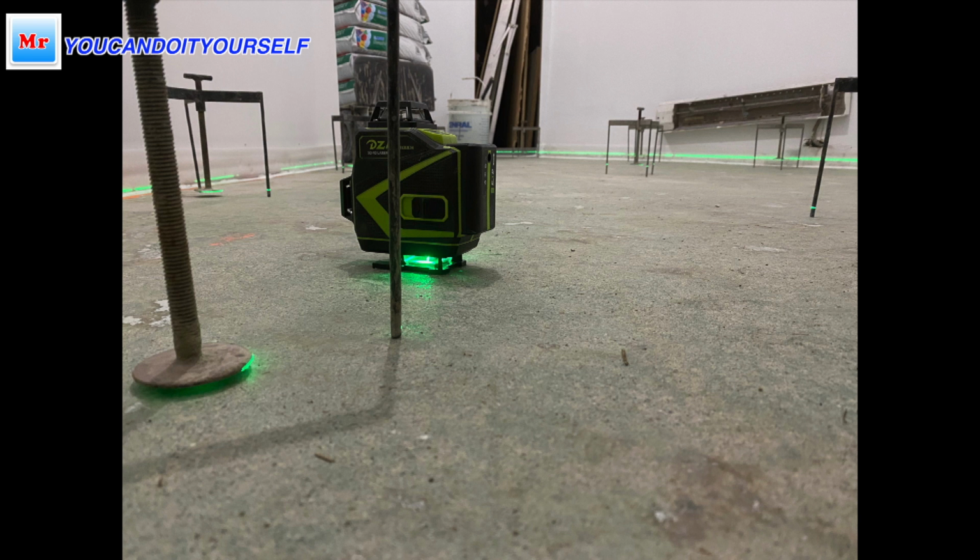For this leveling you need to use the right tools. Here is the 4D laser level, where we have a bottom laser line less than 6 millimeters from the ground floor. It's very easy to find high and low spots, and I'll show you how to set up tripods. Tripods are really important for this leveling. With a straight edge you can do it. All these tools you can find in the description for this video. Let's get started.